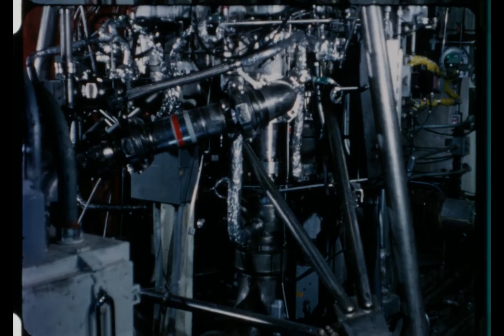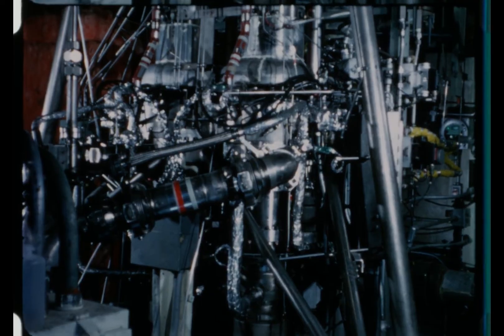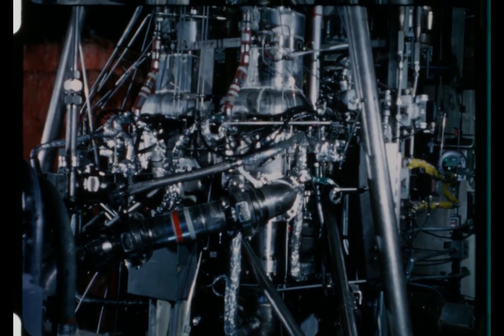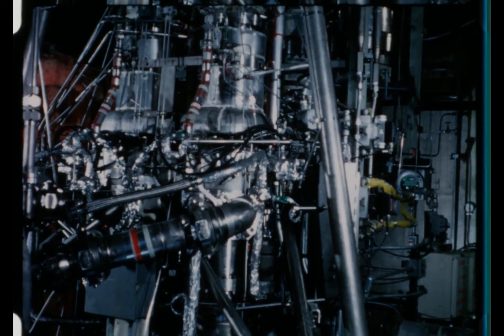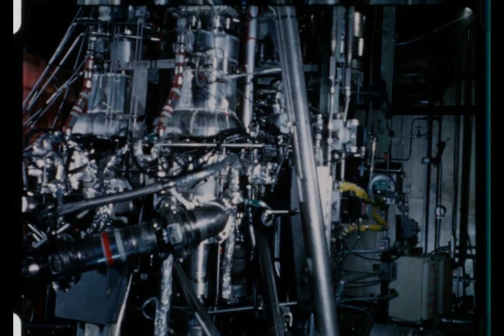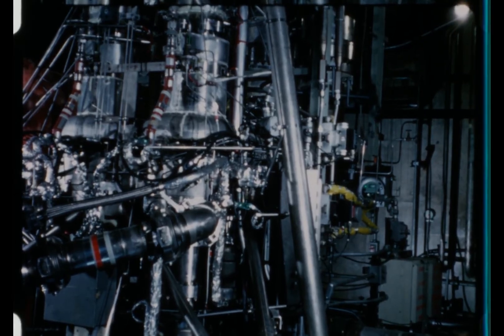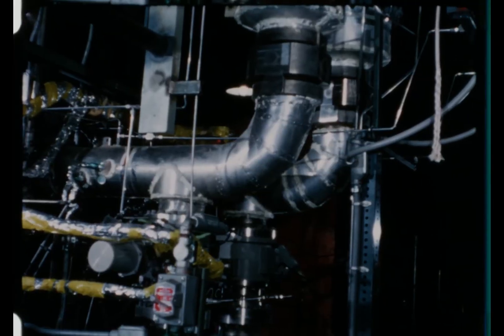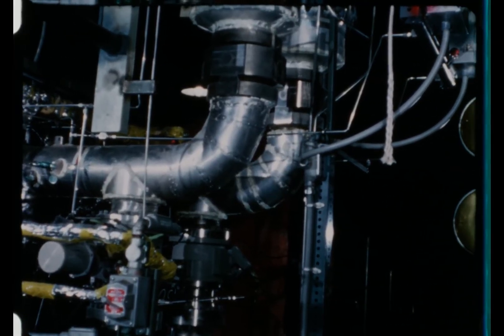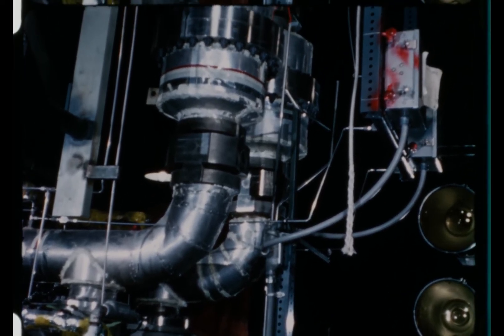In order to provide the greater volume of liquid hydrogen necessary for the more powerful 2A design, two turbopumps were used for the first time. These were the Rocketdyne Mark 25 turbopumps, which delivered liquid hydrogen to the reactor at a rate of 540 gallons per second during the full power run. The liquid hydrogen supplied to the tie tubes during the run was controlled and monitored from the control point.